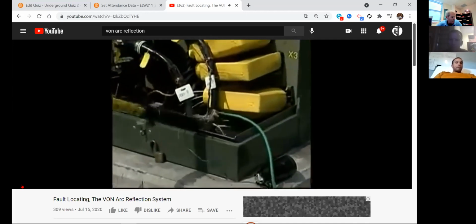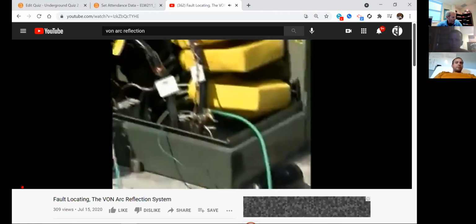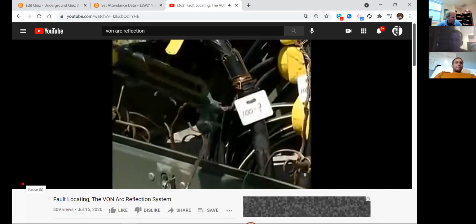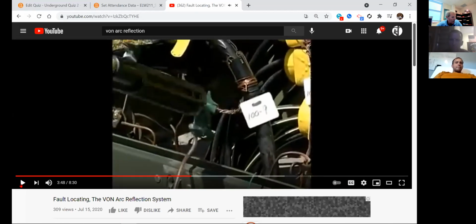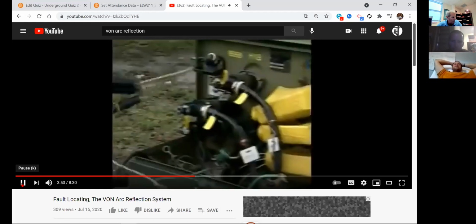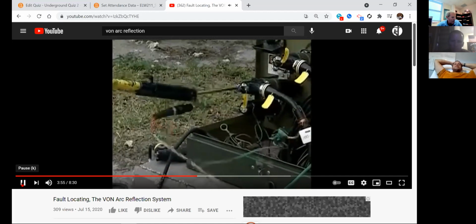Begin by attaching the green safety case ground. Then, connect the high voltage return to the concentric neutral on the cable being tested as close as possible to the cable termination point. So there's a green safety case ground, uncoiled. There's no coil in this one. It goes right with the probe right here. I need a return path, just like in all electricity, to be able to take measurements and find out where the fault's at. Next, remove the grounded elbow. And finally, insert the brass elbow probe attached to the high voltage lead into the bushing.